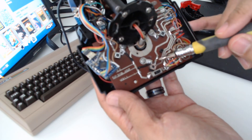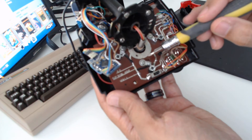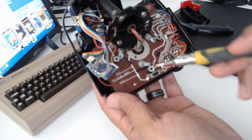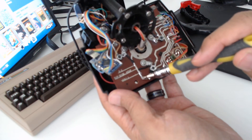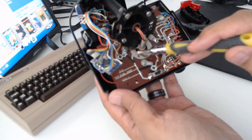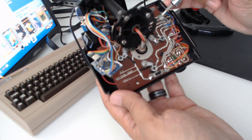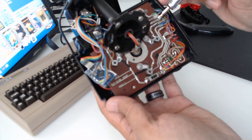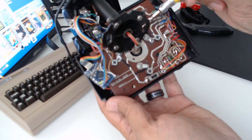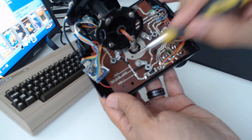All the tracks are exposed here so you'll have no problem soldering — you don't have to scrape off any resin or anything like that. Once that's done, the other end of the switch needs to be connected to ground. This track here is ground — basically anything that comes off this central circle will be ground. Also if you can see from here, the third track has a black wire, and again that's ground. So this is all connected straight to here.